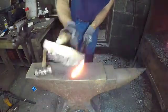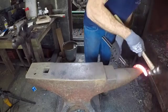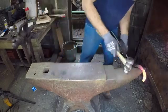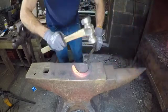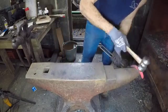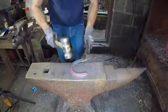For the outside branch you want a nice even heat all the way through from your toe bend right down to the heel. Put the tongs from uncomfortable to comfortable — really look closely at how I'm holding this piece of steel. I work from up and down; my hammer blows are nice and even and my tong hand is dropping gradually and twisting, opening up the beak so that I keep the heel slightly straighter than the toe part of the shoe. You're looking for this branch to begin where you left off with your toe bend and then come into the heel ever so slightly straighter. Continue to make minor adjustments without squashing the steel on the beak. Once finished, level the shoe up.